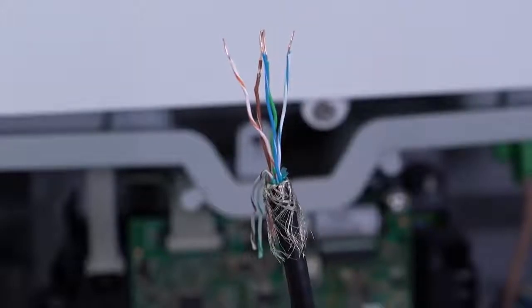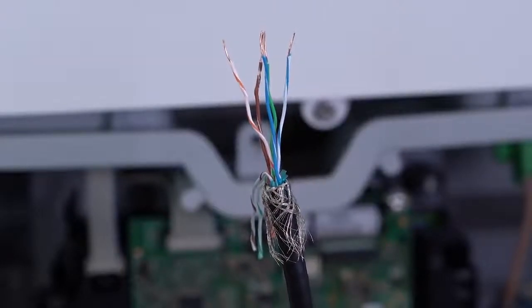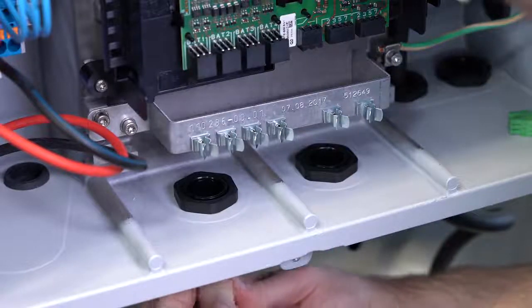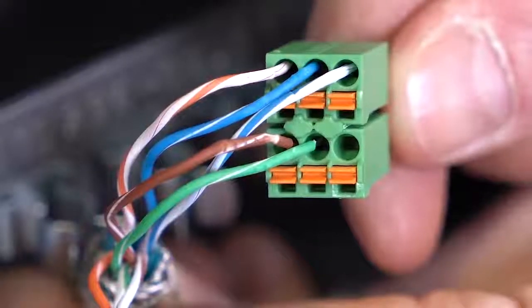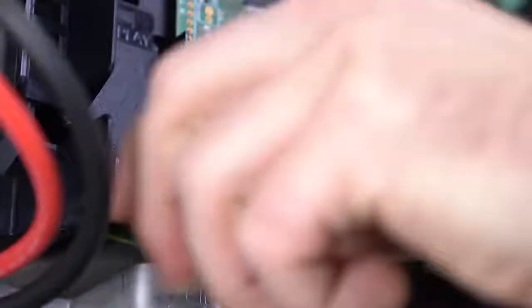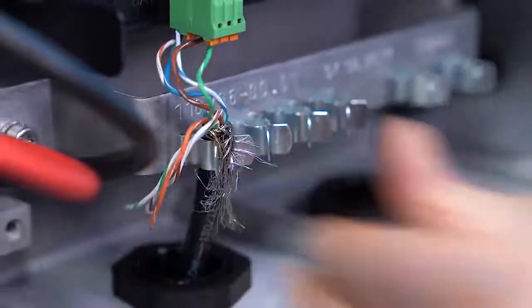All we need for the communication between the battery and the inverter itself is this CAN bus communication cable. We have already stripped the endings of the CAN bus cable. Unless provided as part of the battery, SMA recommends using a cable such as a CAT 5E or similar. Note that the cable is not provided in the scope of delivery. Next, I'll pass the cable through the intended cable gland. Then, I will connect the cable to the battery interface plug according to the quick reference guide and to the battery manufacturer's instruction. Insert the battery communication plug into the socket BAT1 until it clicks in place. Please press the communication cable with the cable shield into the shield clamp.